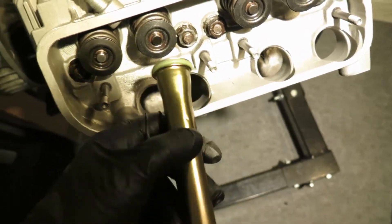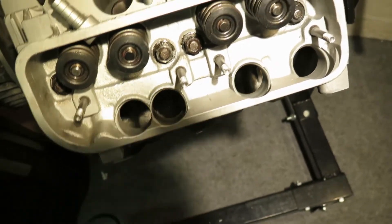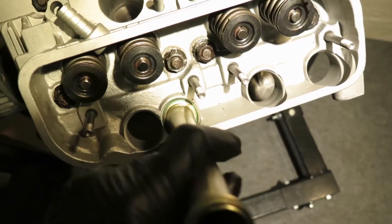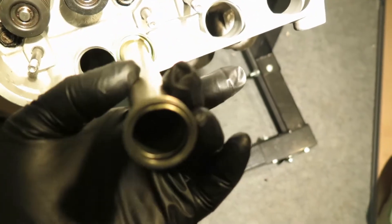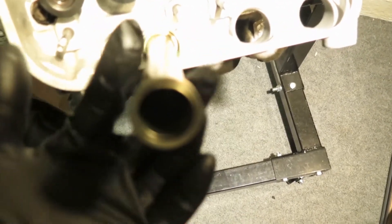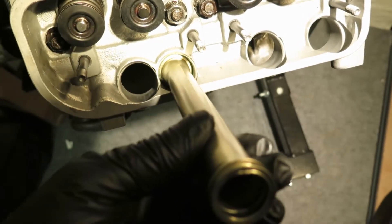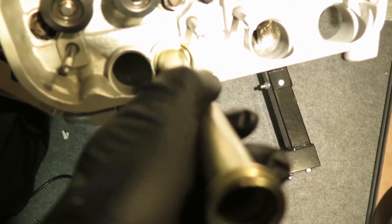This one here has been fixed. What I did is I put some Teflon tape around there — see how snug that is fitting in there. This is about fifteen to twenty thousandths bigger in diameter, and that isn't going to leak. It's in there tight; I'm pulling on it a little bit and it's snug.